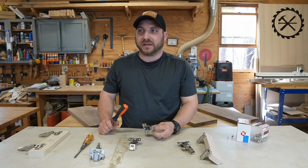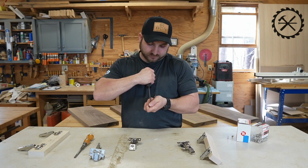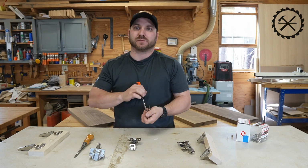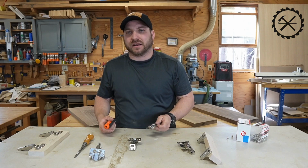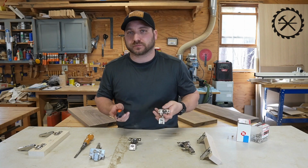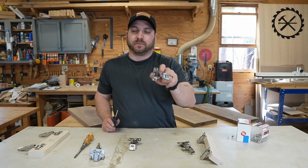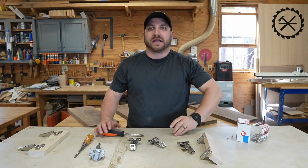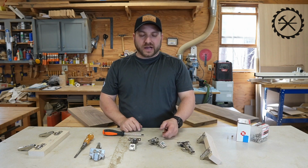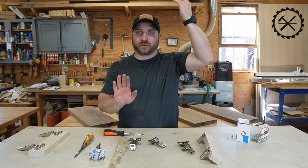You only have maybe, what do you have? Like a heavy eighth. Maybe an 1/8 to 3/16 adjustment. What's tough is sometimes I feel like that's not enough. I just like a little bit more. And then this back screw, all the way back to the end, that's going to move your door in and out. So if you put your door on and the bottom of your door, right where your handle is, you can push on it and it's got a little room there. You're going to want to move the top left corner out to move that bottom right corner in.